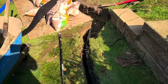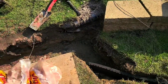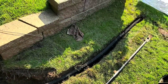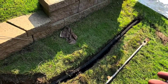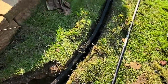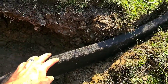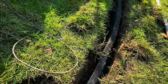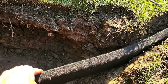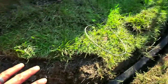This is something you may not be used to seeing, especially if you've been looking online at how to do French drains. This is our main French drain right here — this is going to handle the bulk of the water, the most important part. Sometimes you may have areas that do get saturated, do get groundwater, but not a terrible amount, not the volume that you need for a full French drain. So we use these little capillaries to essentially create a feeder French drain — it's a mini French drain, all wrapped in geotextile filter fabric. We're able to use less labor and less material, and it's a great tool to inexpensively increase the effectiveness of your French drain without having to extend the giant French drain all the way out in front of this wall.